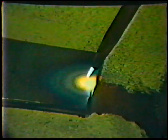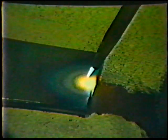You should now be ready to set the gas pressures, light the torch and adjust to a neutral flame with an inner cone about three-eighths inch long. Position the inner cone at the end of the plate approximately one-eighth inch from the surface.